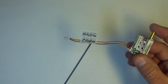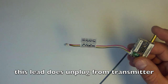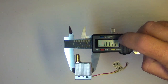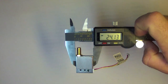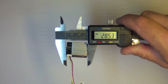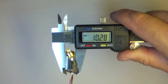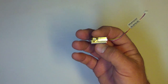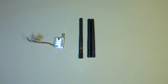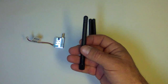It comes with a four-conductor lead that is three inches long, including power, ground, audio, and video. It measures just short of an inch wide, or 24 millimeters; it is 1.1 inches long, 28.5 millimeters; and 0.4 inches thick with the heat sink installed, that is 10.3 millimeters. It has an SMA connector — be certain to keep that in mind when choosing antennas. It ships with a standard omnidirectional rubber duck antenna.